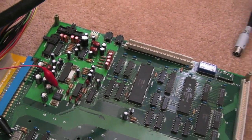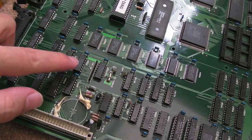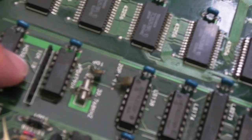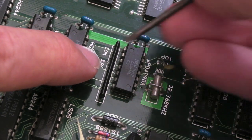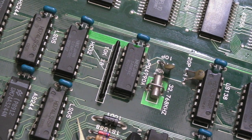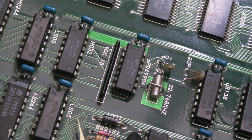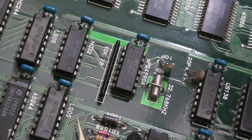So I completed most of the recap a few days ago. An interesting thing — I just came to power it up. It was flashing, and in fact it's now showing all tests pass. I've just got it working again. There was a bad connection — I'll zoom in — it's here. I need to get some solder and flux. You can see where the X is on the silk screen. There's a trace with the slightest bit of corrosion on it. What was happening is I powered it up and it was just flipping around — showing the green screen with blocks down the left-hand side, then resetting and doing the same thing. I thought, oh god, I've got a fault with this board. I stuck the diagnostics BIOS on and I'll see if I can re-simulate the break.